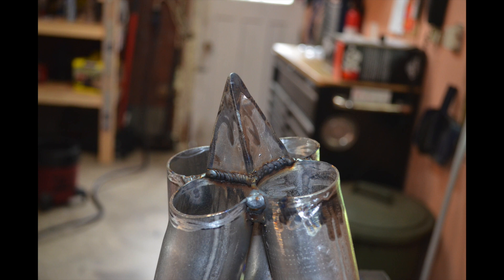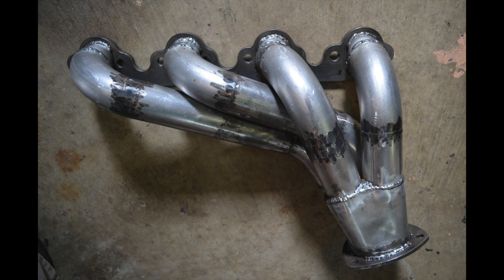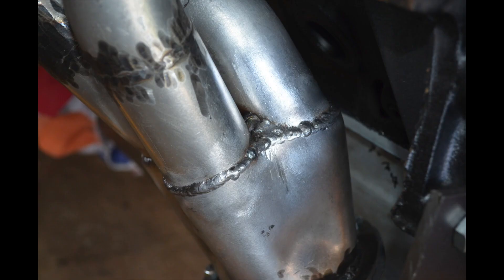Here's a good example of all four tubes welded together — you have to be a hundred percent sure there are no gaps in between. As you can see, I try to weld on the inside as well. Finally, I put it back into its original position where the collector would be, tack weld it, tack weld the collector onto the header, take it out, and then weld it fully, as you can see in this picture.